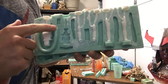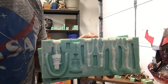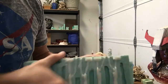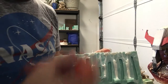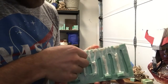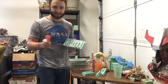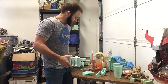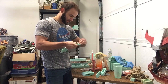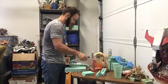Right here we have what's called a worm tube — basically resin has a harder time leaking out through the bottom. I didn't do it on all these molds, but on the next ones I make I'll have a nice worm channel at the bottom. This was just an experiment. One of the worst things to do is be stingy with space — your mold and you will be happier if you just plan for it and allow for the extra room.